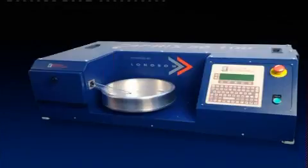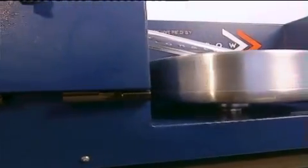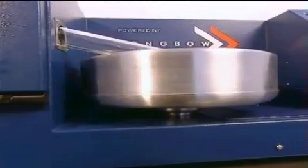The Capri 5100 — the world's first benchtop UV laser wire marking system. This entry-level system of the fourth generation of Capri UV laser wire marking systems provides mark, measure, and cut capabilities for single-core wires and multi-core twisted jacketed cables employed in the aerospace and other key industries.